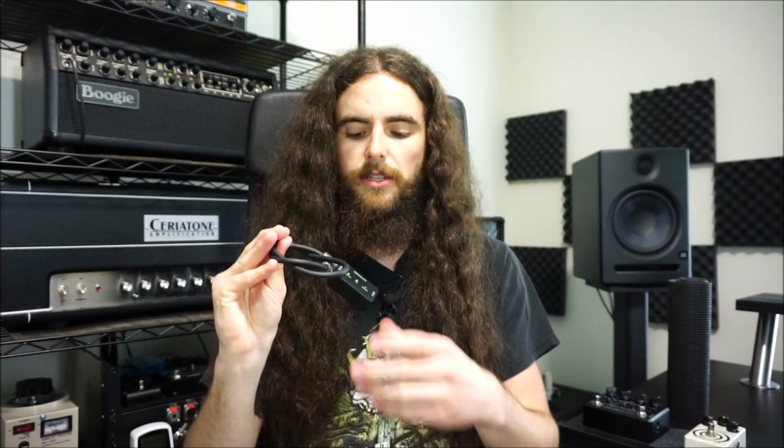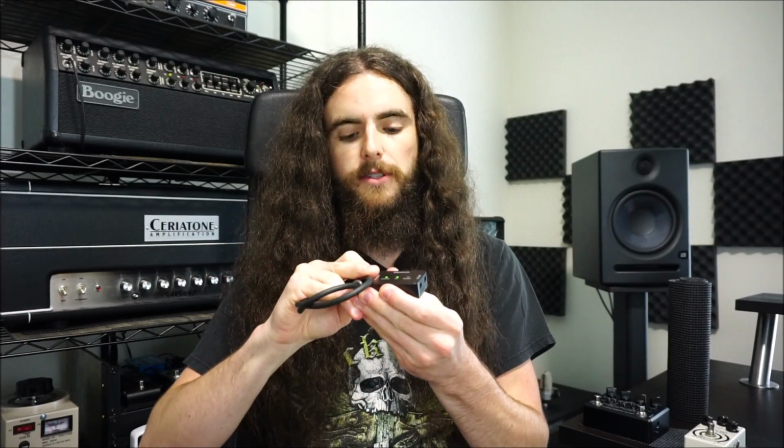What that tells you is that you have a connection between the sleeve and you have a connection between the tip. If there was a problem, and if I can get it to malfunction, see, we have an open tip, but the sleeve is connecting. So this could be really helpful, especially if you're soldering your own cables and you want to understand what the problem is. Of course, a short would light this red, and with nothing plugged in, or a short across the entire length of the cable, you're going to have no lights.